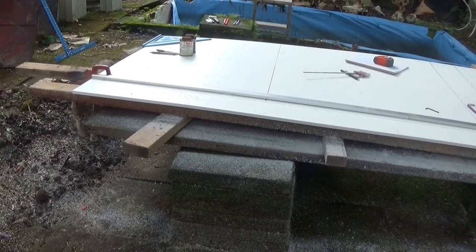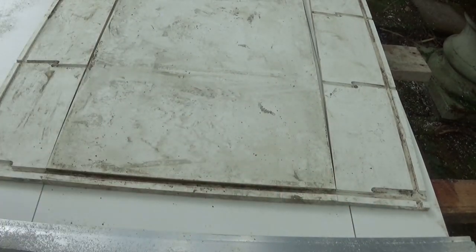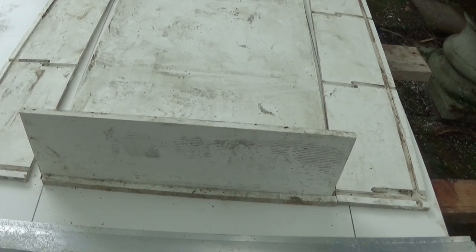I've got the bottom and two sides of a box laid out over the uncut sheet to demonstrate why we cut all the grooves at the same time. You could cut the pieces apart first then cut grooves individually, but cutting the entire sheet all at once is more efficient. When you cut all the grooves together before separating them, all the cuts line up regardless - you don't have to measure each time, so all your inaccuracies work together and it still fits.